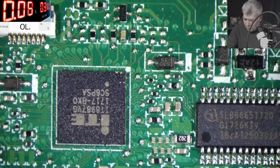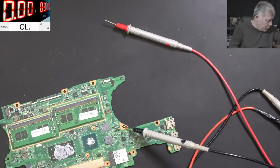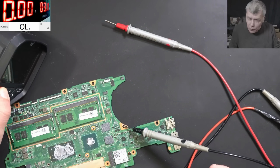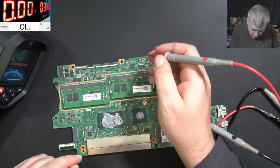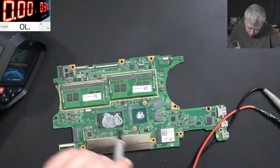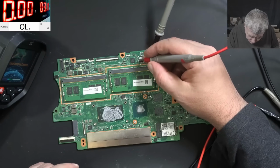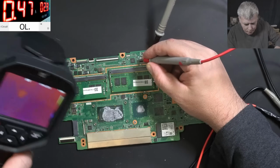So we, no, it's not the EC chip. It's not the EC chip. One second. Let me grab the thermal camera. Those are good news. So we established which is the 3.3 power rail, and the 3.3 power rail has like 10 ohms, right? Coming with a power supply, the EC chip is not getting hot, which is good news. But something is getting hot. Yeah, that current is not disappearing. It's going somewhere. So where is it going?